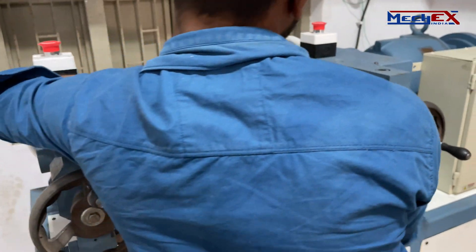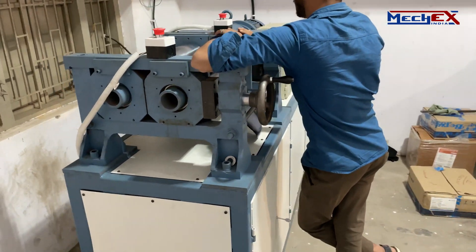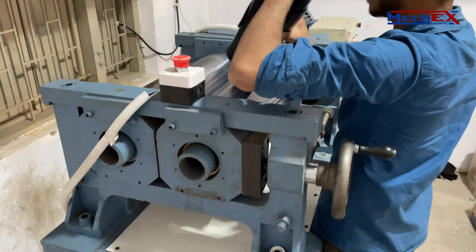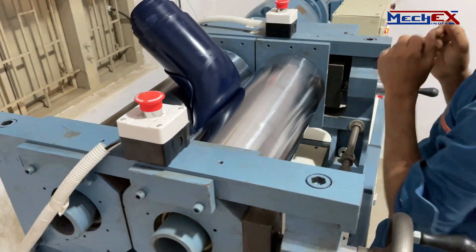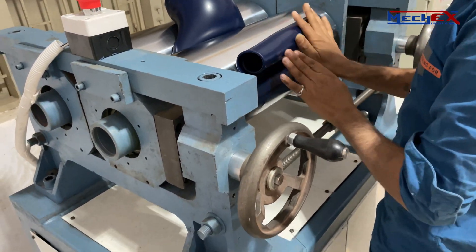Because chemical reactions are occurring during the process of mixing a rubber compound, the compound often heats up. To help keep the rubber compound cool, holes are provided in the rotating rolls for circulating cooling water through them.